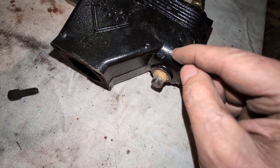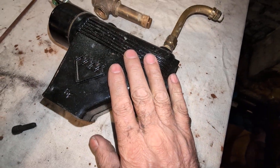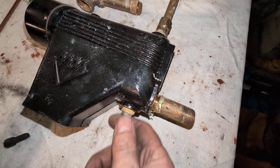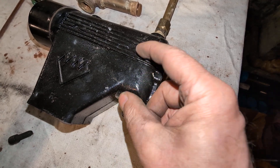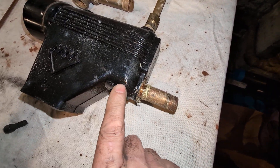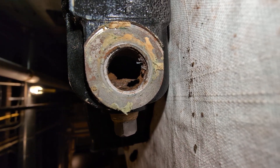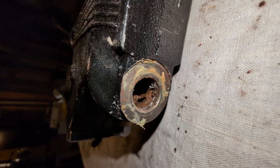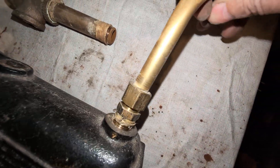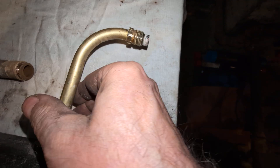This fitting here is for the packing holdback to keep the float that's in here. You've probably seen other videos where I've cut this open. Usually, the plug is removed and the packing float holder is removed, then this plug is put back in. This plug allows you to access this area sometimes because that will get clogged and not allow water to flow back into the unit properly. And this is the compression fitting, which is a half-inch outside diameter tube.